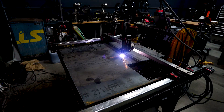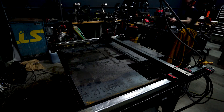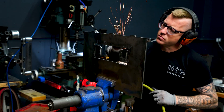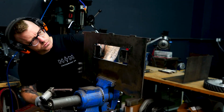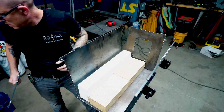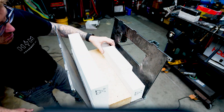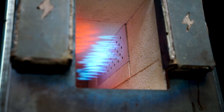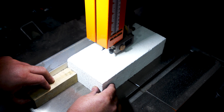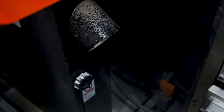Then we moved on to actually cutting out the forge body. This was something I agonized over because the cost of steel now — cutting quarter-inch plate — if I screw something up, it's an expensive mistake. Luckily the cut came out pretty great. I had to do some minor cleanup because plasma is not as accurate as I'd like, but it fit together great. We did a test fit-up with the fire brick — both soft and hard fire brick — and we've achieved a tight fit of the ribbon burner that only requires you to make basically three cuts of the soft fire brick. When you cut fire brick it's incredibly soft — easier than cutting paper on a bandsaw.